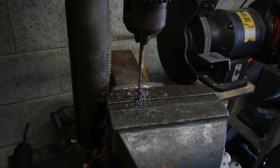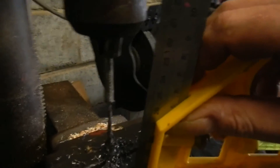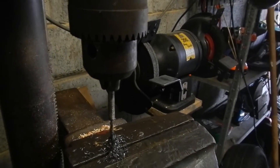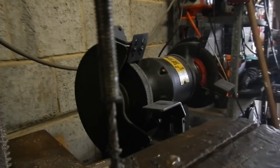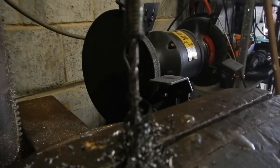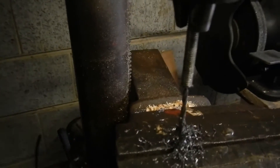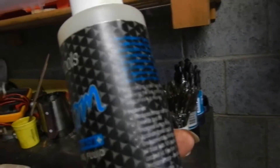Well, now I've got the deluxe model. I've got my bench vise rigged up here, it took me a little while to get this all lined up straight. I carefully squared up my drill bit and lined it all up real good and I can actually drill my way in to that threaded rod. That's a 6mm threaded rod and a 3mm drill bit. I've also improved my setup with cutting fluid — instead of using spray lubes or the old oil can, I forked out and bought some proper cutting fluid. This stuff actually does work a little bit better, not a great deal, you can still use those guys.